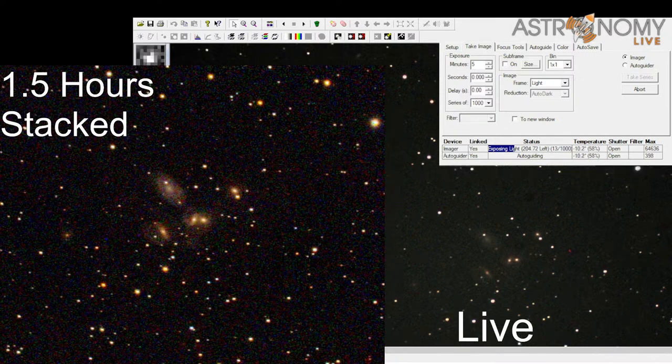And with CCDs, one of the major advantages of that technology as a revolution was that it didn't suffer reciprocity failure, meaning one photon of light should always pretty much produce the same charge on the pixels. One photon of light does not produce the same amount of change in the film media as you continue to add more photons. That's why it's called reciprocity failure. Your reciprocity for each photon is not the same over time.